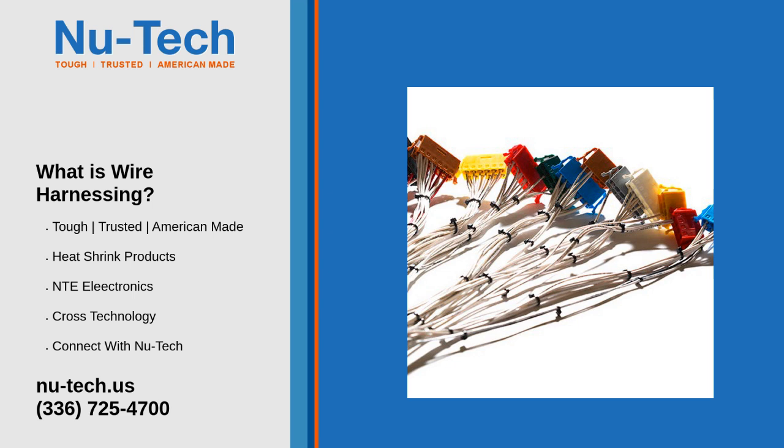Why wire harness assembly is done manually. Wire harness assembly is one of the few remaining manufacturing processes that are more efficiently done by hand rather than automation, due to the variety of processes involved. These manual processes include installing terminated wires in various lengths, routing wires and cables through sleeves and conduits, taping breakouts, conducting multiple crimps, and binding the components with tape, clamps, or cable ties. Because of the difficulty involved in automating these processes, manual production continues to be more cost effective, especially with small batch sizes. This is also why harness production takes longer than other types of cable assemblies — production can take anywhere from a few days to several weeks, with more complicated designs requiring longer production time.